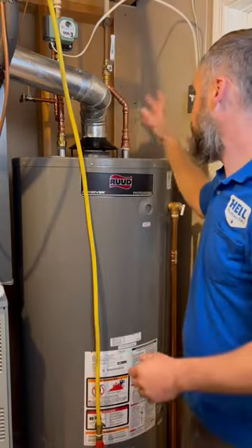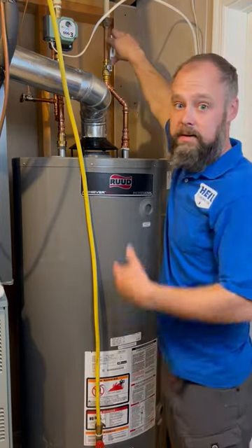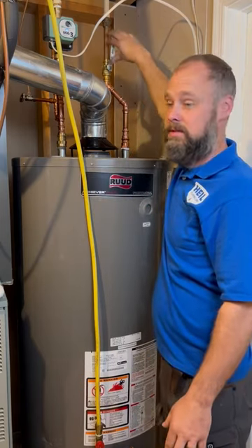Okay, let's get to it. The first thing we're going to want to do is shut the water off. The shutoff valve will be on the right side — that's the cold side — above the heater. Here we have a new ball valve, real easy to use. Sometimes you have the wheel ones and you've got to turn it a few turns until it stops.